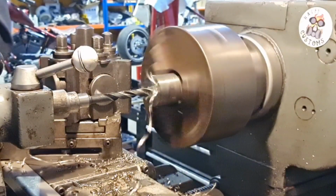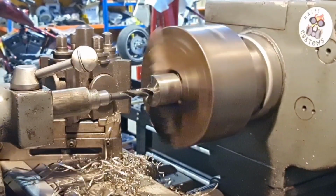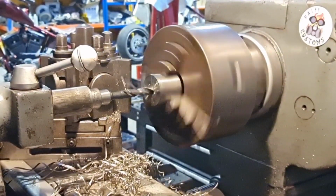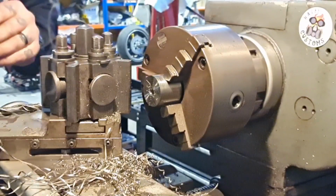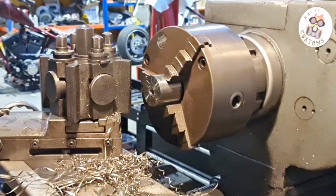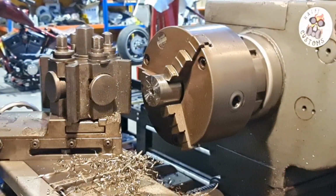And I'll gently drill this through. You can join me when we're there. Alright, we're just coming up on that now. Just breaking through. And no indications from that broken bit. You know, there's nothing to feel in the tool while that's going off. So I'll wind this back. I'll release this. Release that. My faithful centre drill, pilot drill. Right, now I need to measure up.